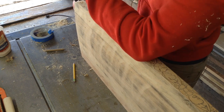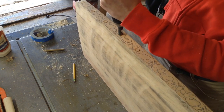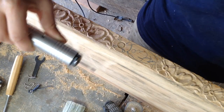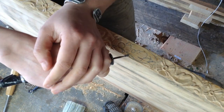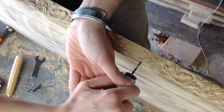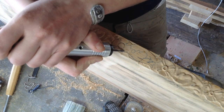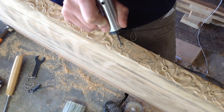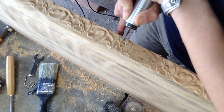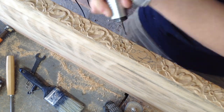Since these were flowers, I tried to make the carving go as fast as possible because it was a lot of surface area. I had a plug-cutting bit that I used on the centers of all the flowers — not only to help get that circle in the center, since circles are really hard to get perfect, but also to create the depth in the middle of the flower already. I mostly carved this and then filmed the last bit. I'm using a rough cylinder-shaped bit to go through and remove the bulk of the material, basically outlining the pattern. I'm focusing on removal, not defining the lines yet.